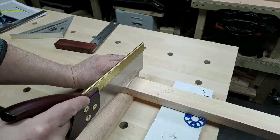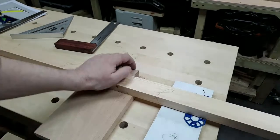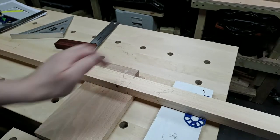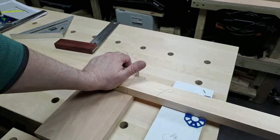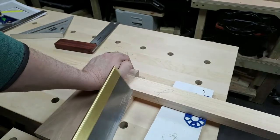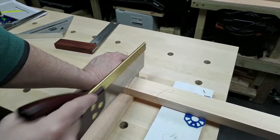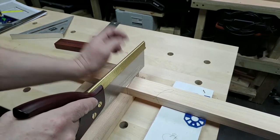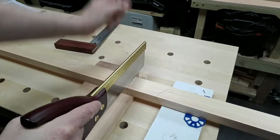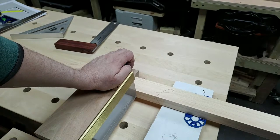And if I'm having that corner over there, just get that started. I have to keep blowing that timber out of the way. The other thing that I'm doing is keeping the heel of my hand up against that bench block and keeping that timber in there, holding it securely, but also guiding the blade with my thumb. Well, I don't guide my blade with my thumb sticking out here because I've cut that far too many times and it's very sensitive. So I use my knuckle to guide it. And it's held up quite high. I'm going to guide that blade there. I'm going to cut down here and keep that going. And at this stage, if we could pan out so that we can see where I'm actually standing when you're cutting, if you're aiming to cut a straight line. So if we can pan out to the main camera and hopefully you can see it if it's available.